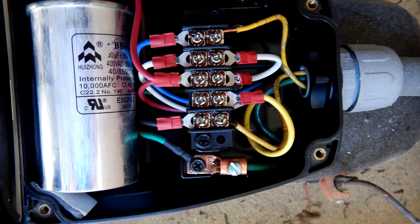Here's a quick look at 230 volt wiring, which is very common. You have your green ground wire, then load one on terminal six and load two on terminal ten. There's no need to move any of the other wires.